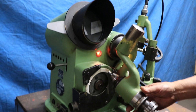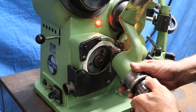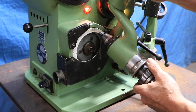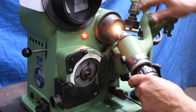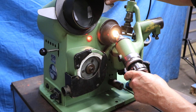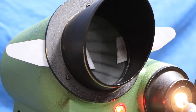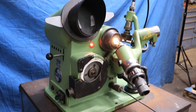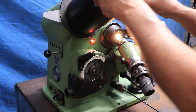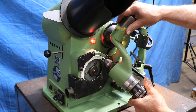Coming in here with the camera — you have your drill and you can grind this angle on your drill here. Then you step on your foot switch and bring the drill up to the next position. You can actually see this drill inside this screen and check the angles on it and the edges against the chart in there. There's also a hood that goes on here that makes it easier to see when you're working. Once you find that's all right, you go back and do the other side of the drill.